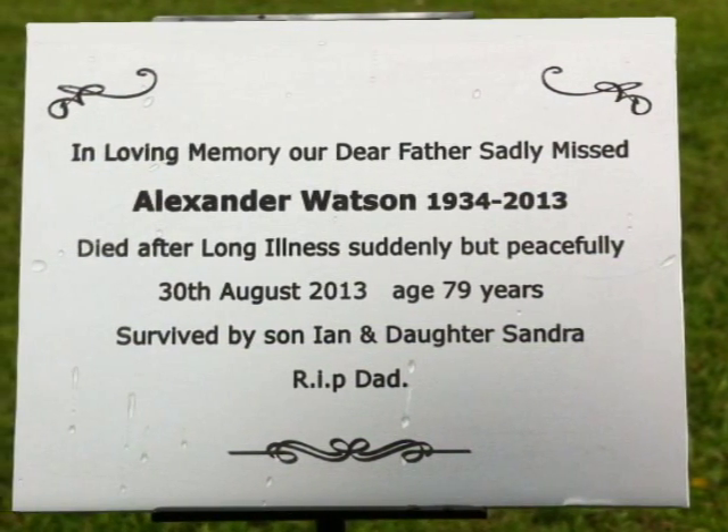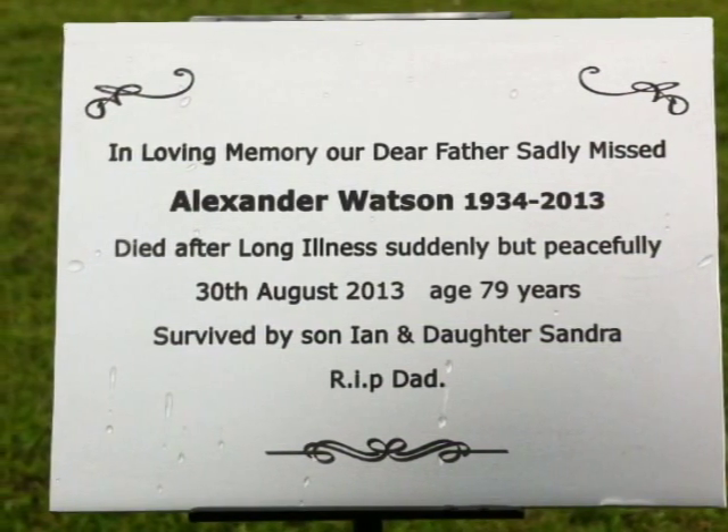For this demonstration we will use outdoor grade aluminium anodised to 25 microns. To begin, we laser mark the aluminium without any spray applied to it, because this way we found the finished product turns out better. The settings we used for this process was 100 power and 50 speed.